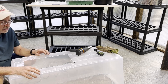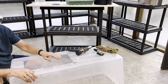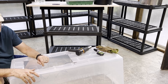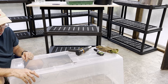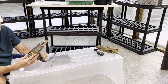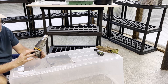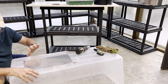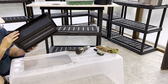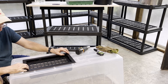We've got our hole cut out of our tote and it's perfectly cut. I will tell you that if you try to use the jigsaw, it's just too powerful. Most cutting tools will cut through this and cause chipping — I'll show you in a minute one that I'd done previously. It has a lot of chips in it because I was trying to do it the shortcut way. So if you take your time and do that slowly, use your heat gun — or if you don't have a heat gun, use your hairdryer. You can get these at the big box store or on Amazon. This really makes it easier because it softens up the plastic and makes your razor blade easier to cut through. This is how we're going to set it in there, though we still have an air gap around the edges, which is why we're going to need our special electrician's tape.